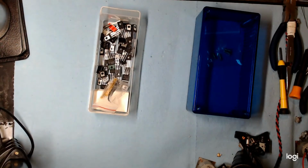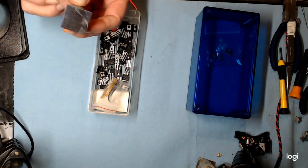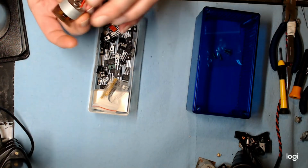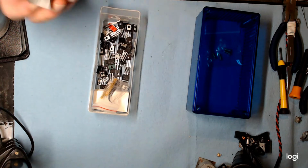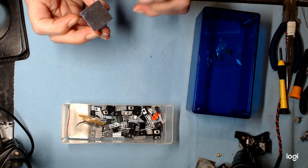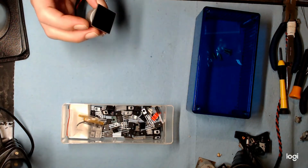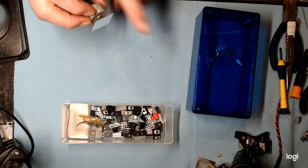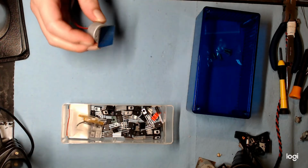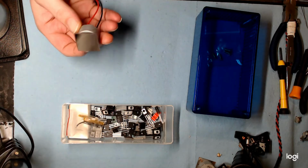What you're going to need, first off, you need motors with mirrors. This is probably the trickiest one. If you want a decent effect and a decent beam, you got to get first surface. And if you use a regular mirror, you're going to get artifacts of extra 2 dots, typically off of one reflection. So you'll have a strong dot and then weak dots.